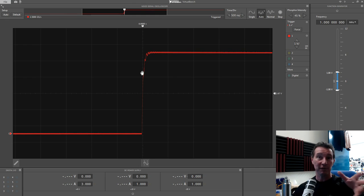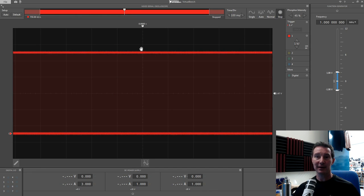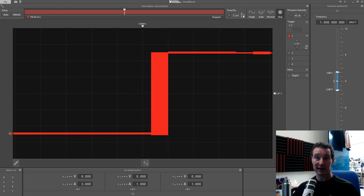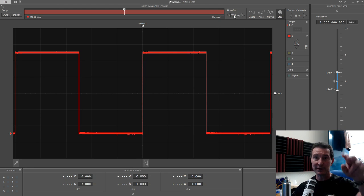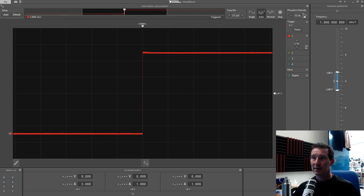It's streaming just the display data to the PC via USB, WiFi, or Ethernet. When you stop the acquisition, that's the point where it uploads the one meg points of memory. So if we go way out on the time base and stop it, we should get the full one meg capture and be able to zoom in. I'd like to see how much memory it's using displayed on screen — that's a bit of a fail that it doesn't show that.